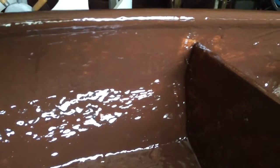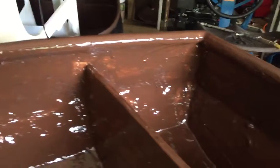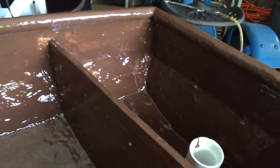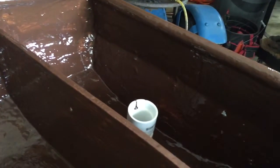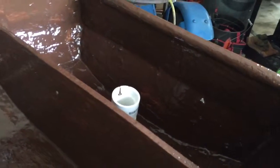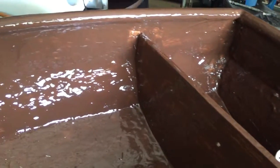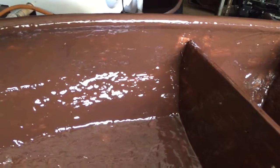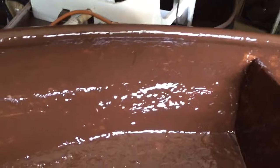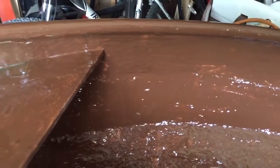The reason why I don't paint directly on fiberglass is that having the resin dyed with the brown paint provides better coverage and is a lot more durable. I've tried this process on other boats that I've built and it works very well — it's a very cheap and inexpensive way to do this instead of buying a marine paint.